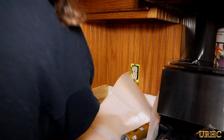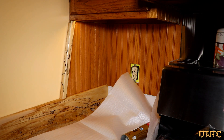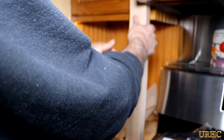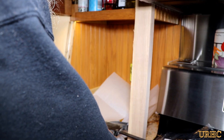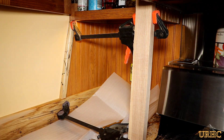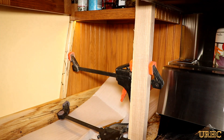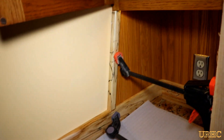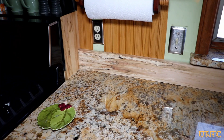There's a rabbet that goes up around all the wainscot and ties it together. I got that sitting in place and used a board between the microwave and the stove as a platform to put pressure outward so I could get a real tight fit against the wall and hold it until the glue dried. I used some of those free clamps from Harbor Freight — they're pretty nice because you can use them as extension clamps to put pressure outward. You can see a little bit of squeeze-out on the wall, which is real easy to clean up — just a damp piece of paper towel and it comes right off with this latex-based stuff.